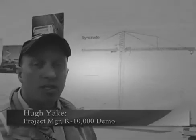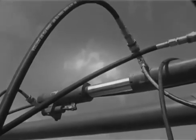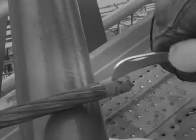In order to do this, we used a strand jack system, which is a hydraulic jacking system utilizing a strand jack cable. A strand cable is a collection of wires which looks, in all intent and purposes, like cable, but it's more like miniature bars all wound together, creating tensile strength.